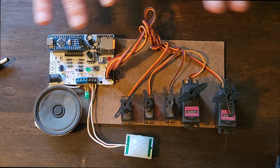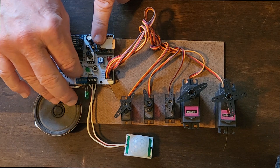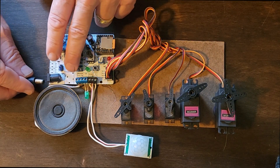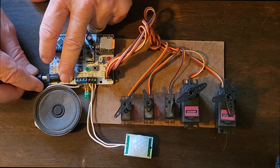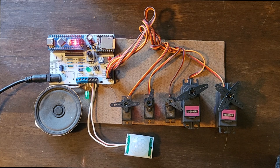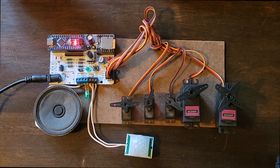4-amp is probably better, just in case you run into some issues. When you're going into setup, make sure that you take the jumper and put it onto the setup mode. I will apply the power, and it will show me that it's in setup mode by moving these things, and you'll notice the ambient sound does not come on — it would if it were in ordinary play mode.